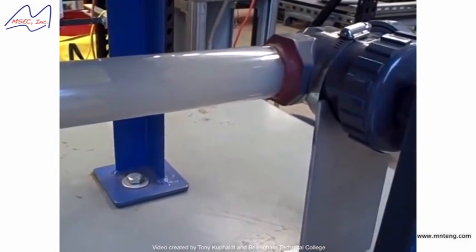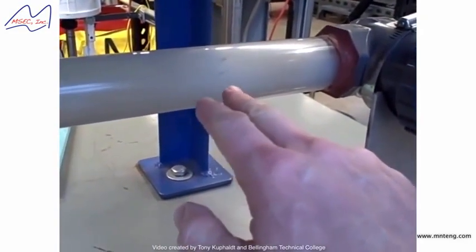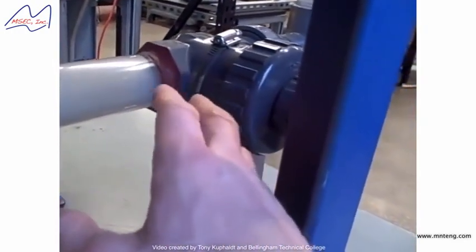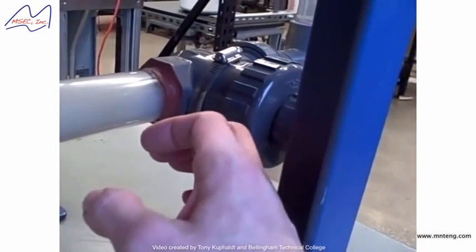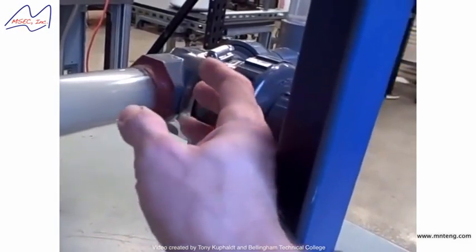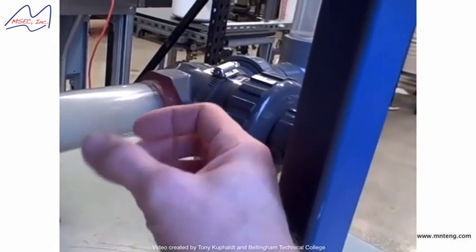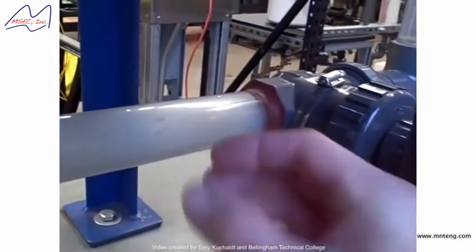You can really hear it now. You can see it occurring — it's a very pronounced action and noise. As the water goes through the valve, it reduces pressure going into the restricted valve. Its pressure drops below the vapor point of the water at this temperature, and it flashes into steam. Then after it comes out of the valve and expands again, the pressure goes up, and those vapor bubbles collapse back into liquid — and that's when we get the cavitation effect.